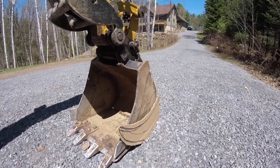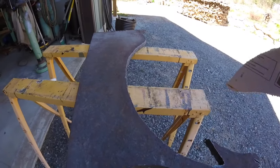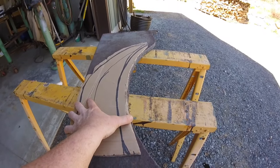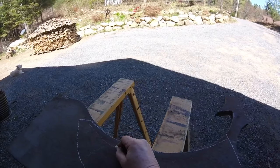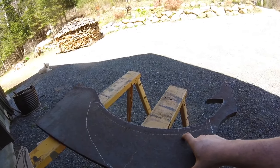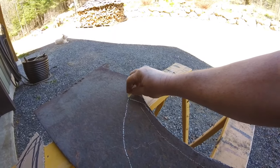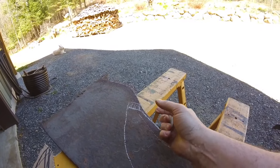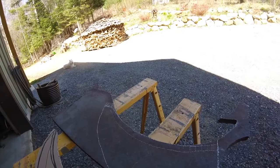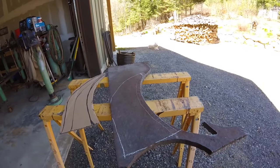I'm gonna gather up my steel and we'll see you up in the shop. Here we are up in the shop. I've got a piece of one-inch steel plate that I've dragged around forever. The last thing I built out of it was a pair of rock tongs, where I did a nice curve that happens to line up almost perfect with the curve in this template. I'm doing a quick bevel on this so it'll be beveled down to an edge. I moved this back as far as I could and gave myself a little bit extra on the leading edge. I'm going to extend this down here as well — it'll be beveled this direction and then turned around and beveled the other way with the torch, so I don't have to grind off all of this to bring it to an edge. A little bit of prep work with the torch will save me a lot of grinding discs.